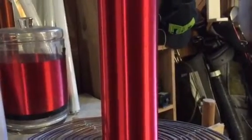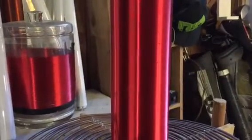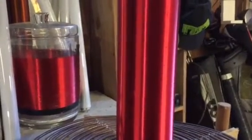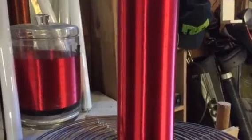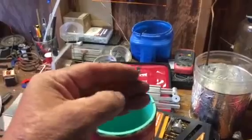So if you remember yesterday, I got some nice scorch marks, which this coil should have scorch marks. If you watched the video I made yesterday, or should I say the previous video that I posted, I'm putting through this 15,000 volt 60 milliamp, and it's 30 gauge wire, guys. The wire I've been using, say on this coil here, is I believe like a 24 or 22.